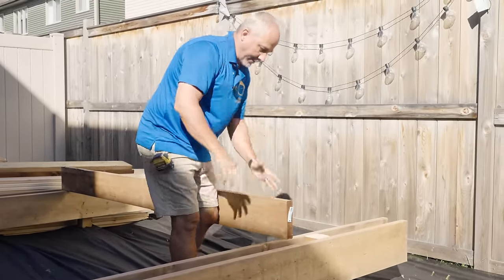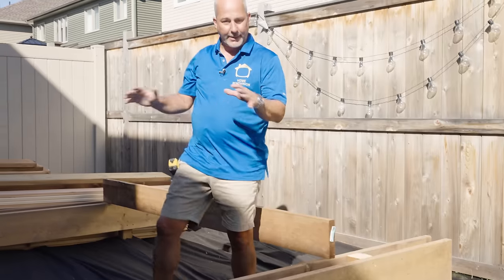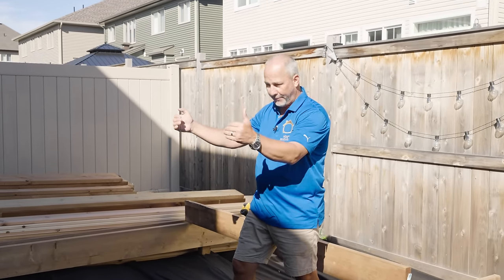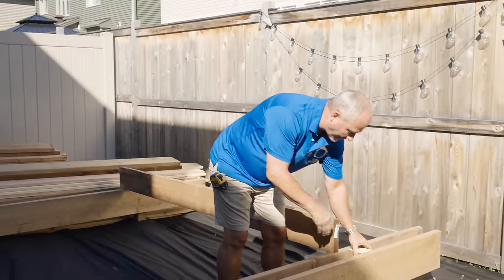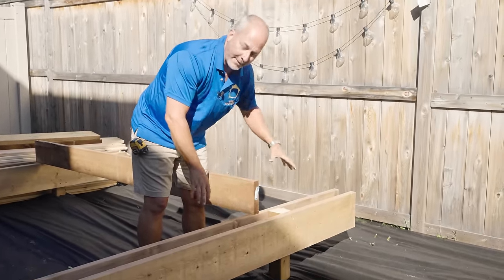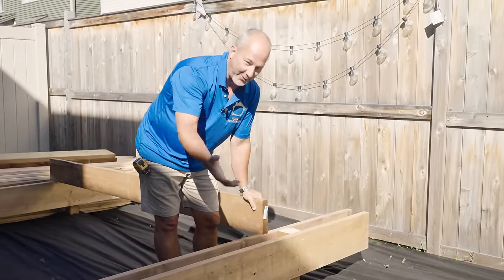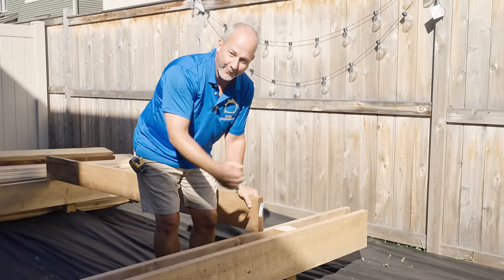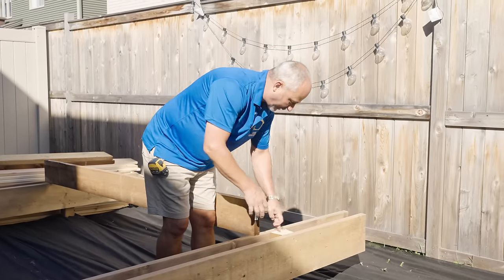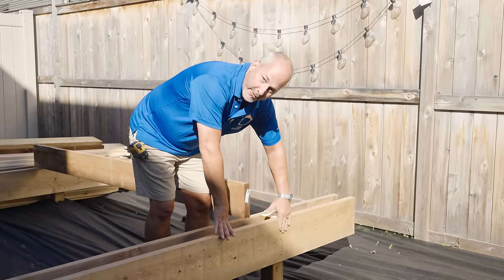Nice and simple. So really when you're doing this, you're setting up your layout, start from the middle, okay? Find something, measure off from the house the same distance. This type of system is incredibly merciful because you don't have to put the block at the very end. You've all seen the decks where the deck blocks are exposed and they're cutting the skirt around the concrete block.